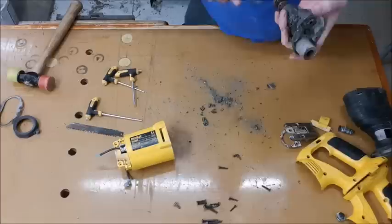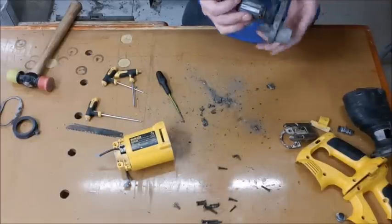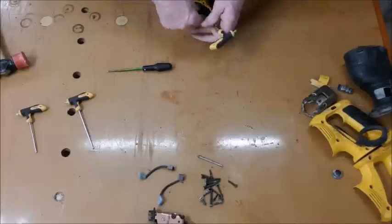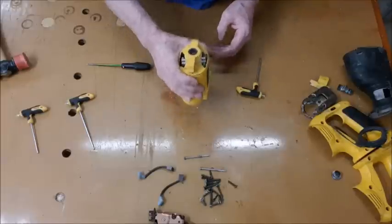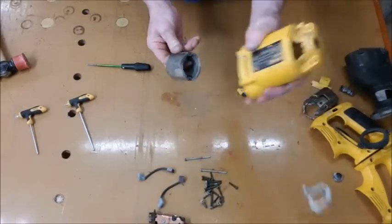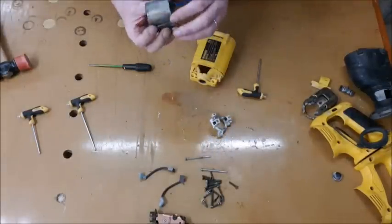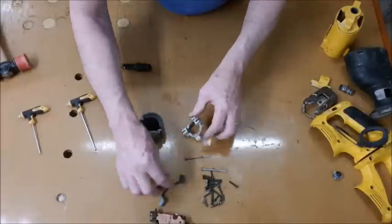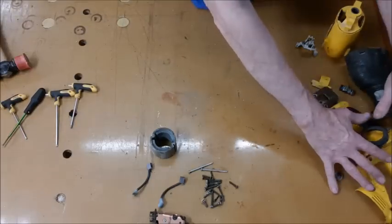I've left that one to soak for a bit. So I'm going to try and clean that without getting all the coil too wet. Okay, suspend that under the 2 screws, turn it upside down and give it a tap. It's coming. It's coming. Just tight. Spring's still in there. Good, okay. That can be washed out. That can be cleaned up, put back. That can now go to the washing machine. They're fine. That can be washed. Right, them bits are all going to get washed.